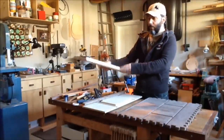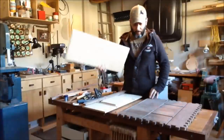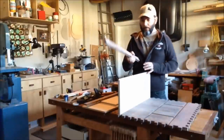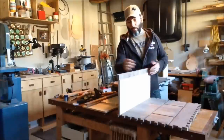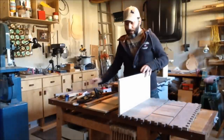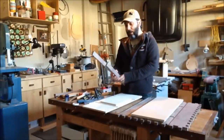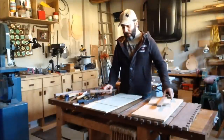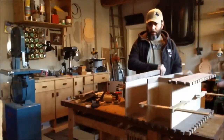The three-quarter-inch plywood grooves are all done — I did the four sides, tongue-and-groove at the front, and then a half-inch lip that slides into the recess. My front strip that's tongue-and-groove slides right in. That strip will go in after the glue-up so I can get a precise measurement of the inside and glue it without any gaps. My next step is to do the same with the half-inch pieces, adding front strips for the small pieces and for the middle section. All the parts are fitted and I'm pretty pleased with how they all come together.